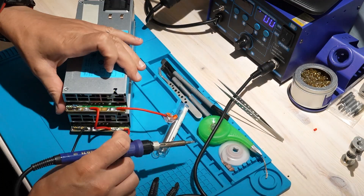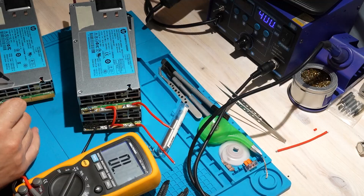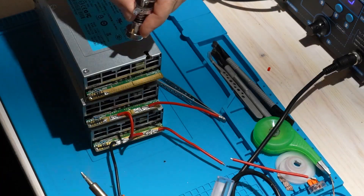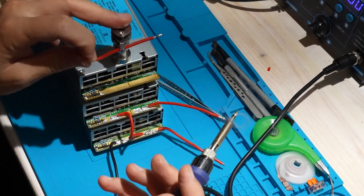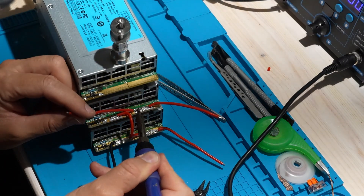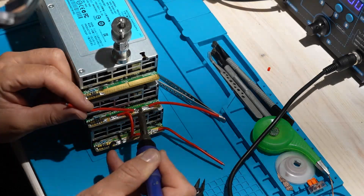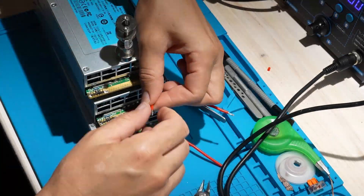Now for the bonus part — let's connect the third power supply. First I add output positive terminals for each PSU, which gives us 12V, 24V, and later 36V. Then I wire the positive of the second power supply to the negative of the third, and add an output wire for the top unit.